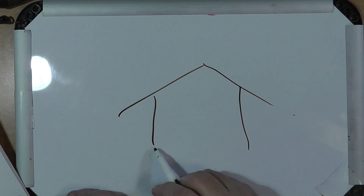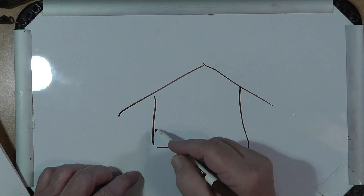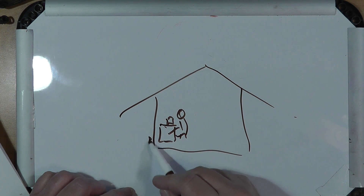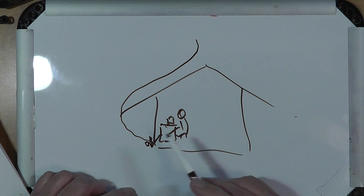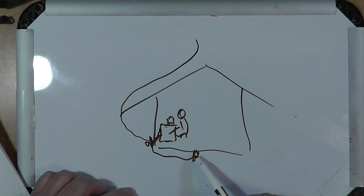Now, I'm just going to draw a little picture. Let me back this thing out so we're looking at the entire whiteboard. You've got your building here and it's made of metal. You see them really often out here in the West where they are outbuildings made of metal — it's just the common way of doing things. You've got your station in here and you're sitting here doing your thing. There should be a ground rod right here. Bring your antenna lead-ins to there with the lightning arrestor and then go into the shack. Have your shack ground go out to that ground.